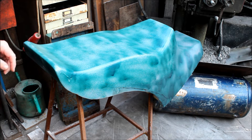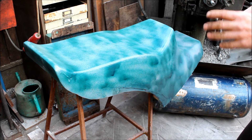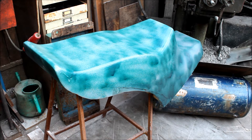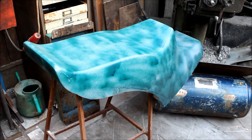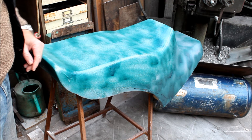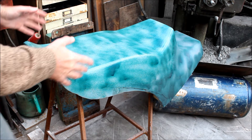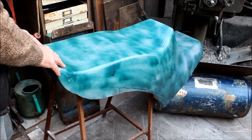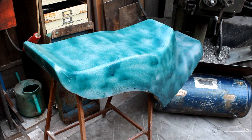It still needs a bit more work — four coats of primer have been brushed on and it's been flatted off with 150-grit. As long as it's got a nice shiny finish, you let the paint go off, then put wax on it — you need some special wax. For the gel coat, it's probably better to spray it on rather than brush it, because brushing might leave lines. The neighbor will use this plug as a guide to make the mold, and from that the final seat unit can be produced. Once the mold is made, you can make as many as you like.